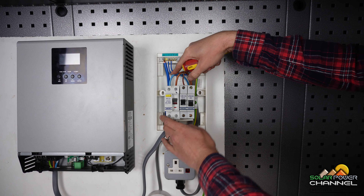Here we are — I've brought you closer to the bench. This is the consumer unit; I've left the cover off and brought the cables in through the front so you can clearly see them. Normally you'd bring them up through the top and through the bottom. This is our incoming cable from our inverter.